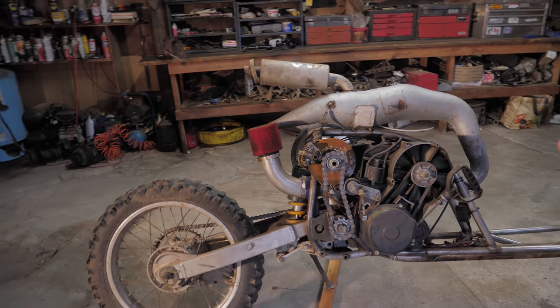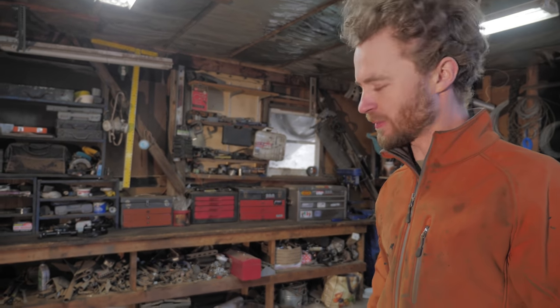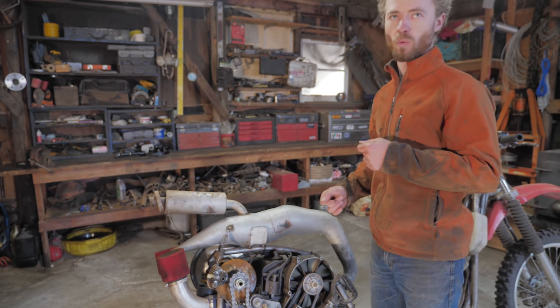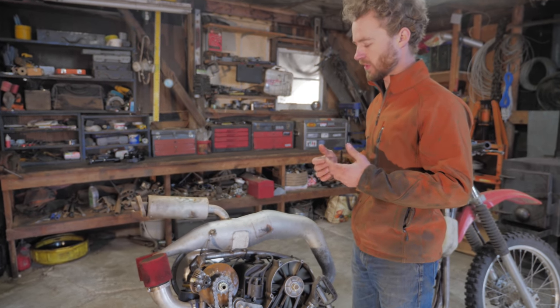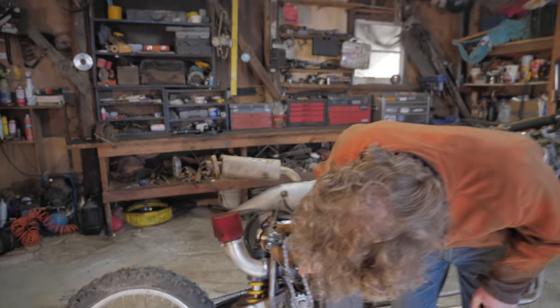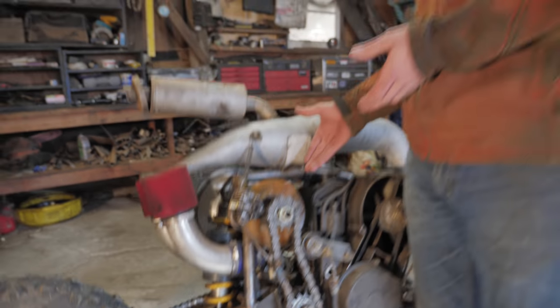In this video, the mountain scooter will come to life, but that is gonna be a lot of work. Basically, the current setup isn't gonna cut it. So the carburetors are one of the big problems. We have another set of carburetors over there, and they're quite a bit larger, just physically, not necessarily in terms of how much they flow. But anyway, they should be more tunable. They're flat slides, and there's not a lot of extra space in there. So that's a problem. I'm gonna need to make more space for the carburetors.